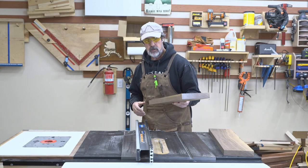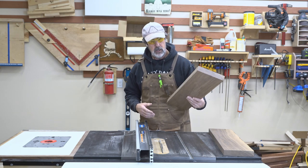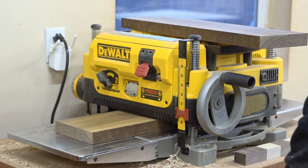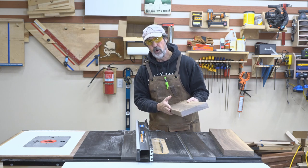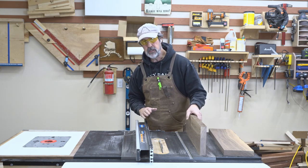Time to cut these into two and a half inch strips. Before I brought it over to the table saw, I jointed one edge so it's perfectly flat, then put it through the thickness planer to get it closer to the thickness of the chessboard. I'm not worried about the other side because I'm going to flatten everything once the border is on the chessboard with the CNC - everything will be flattened together.